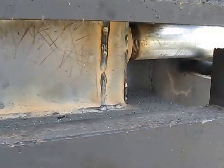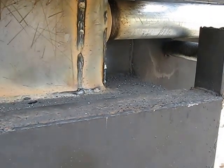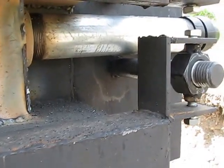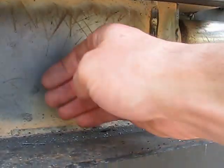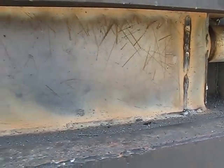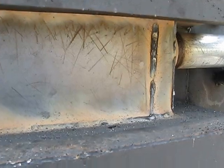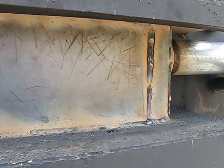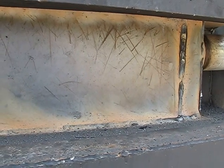I've increased the flow to my primary burn area. The problem is I'm running off one blower. I have a tee off where a two-inch line comes into a manifold here in the front. I'm really happy with this — it works very well, it's very hot, heats that whole manifold up and preheats the air well. I've opened up the area inside the primary burn area so I've got a lot of air flowing in there.